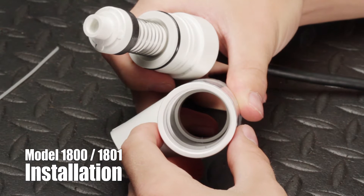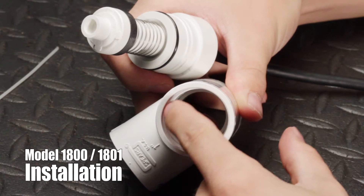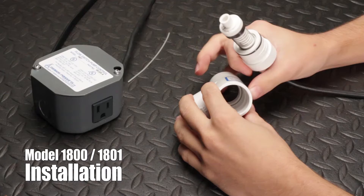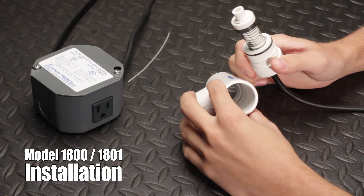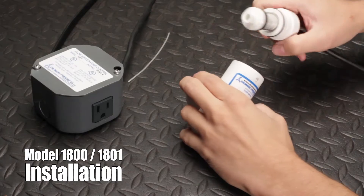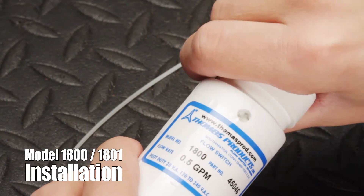Next, install the PVC body by inserting the pipes into the ports. Make sure glue and debris do not get into the body and everything is clean. Reinsert the bonnet assembly back into the body — it helps to apply petroleum jelly to the o-ring. Lightly twist into position.